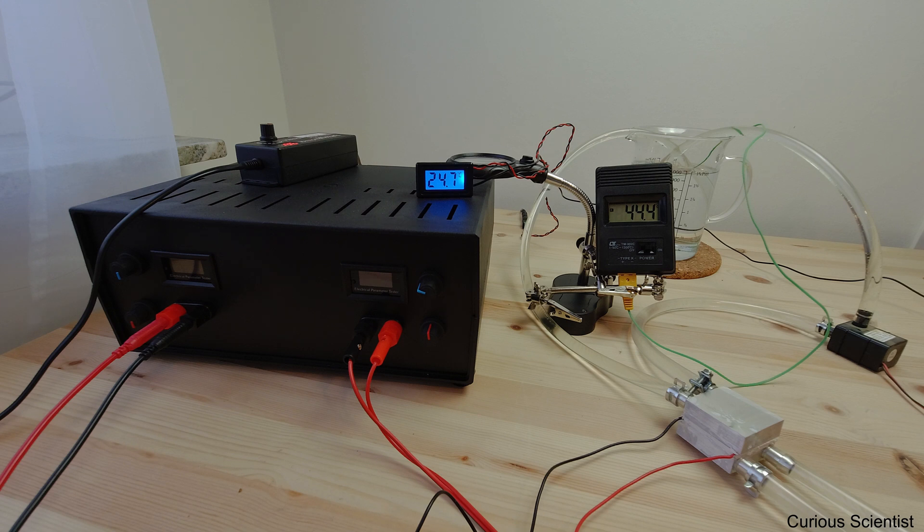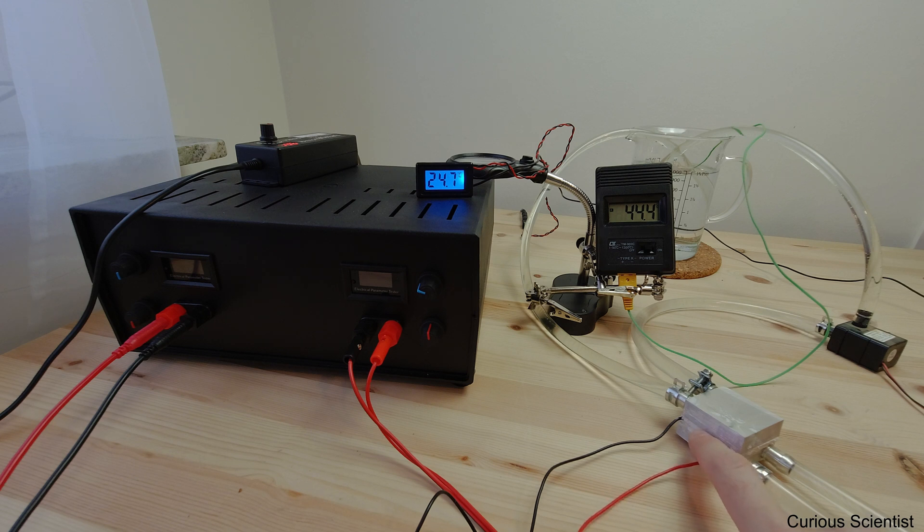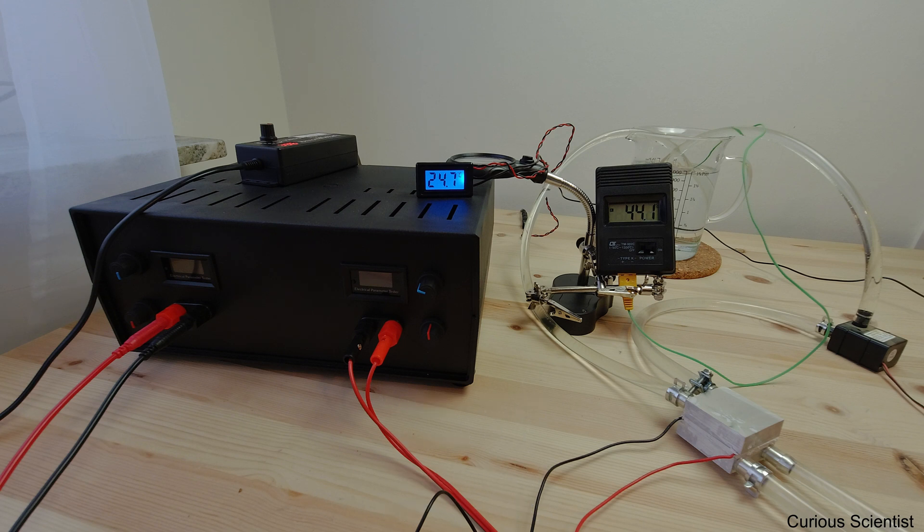Previously, for example in my previous video, I was trying to cool something down — a cup of water placed in an insulated box via heat transfer through the air, and that's not too efficient as we know. So here we have basically a direct contact, because the only thing between the circulating water and the cold side is the silicone heat grease and then the aluminum block. This is also a better performing thermocooler.